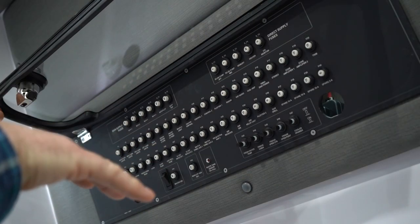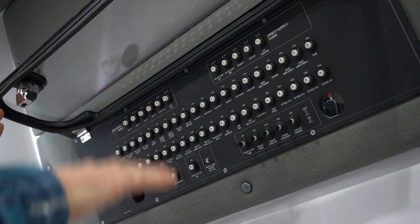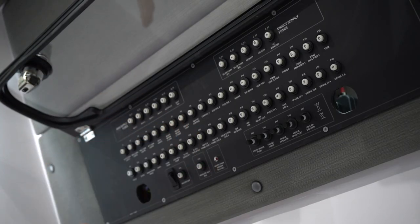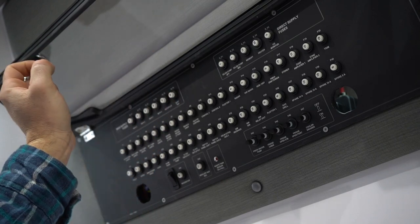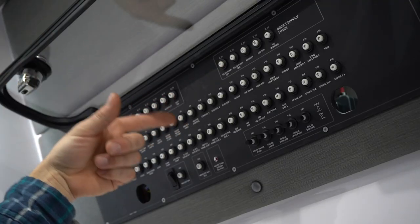This is the location of the DC panel — it's located in the toilet compartment just above the sink. So if you ever have an issue with the system, something's not working, this is the first place to check. You'll know because a breaker will be popped out, and all you need to do is push it back in and then retest whatever's not working on board the boat.